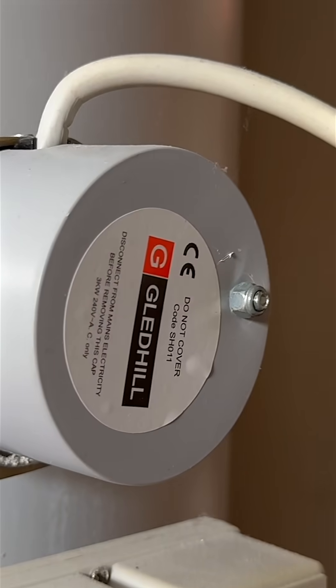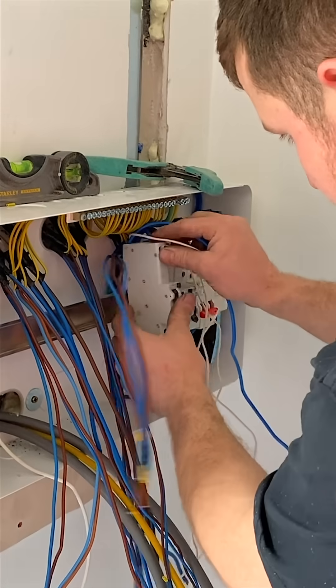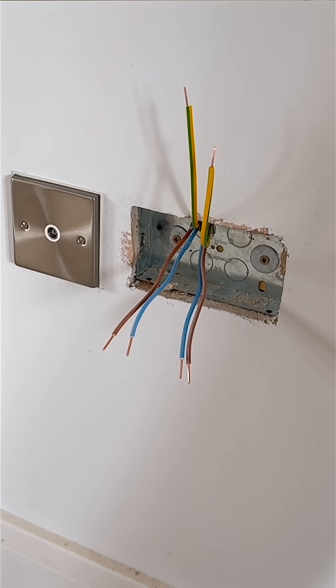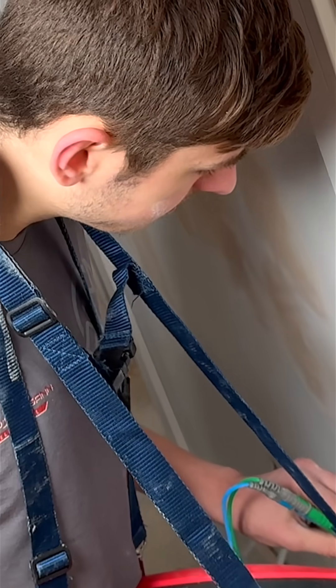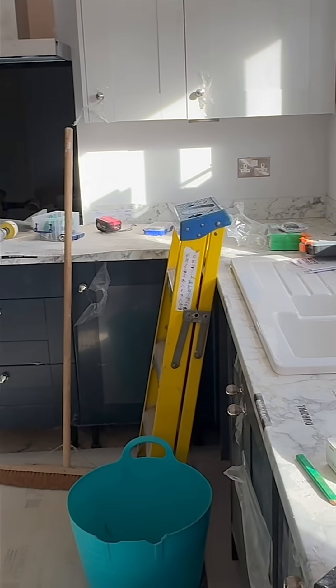Things like immersions, heaters, showers, and incandescent lamps should be disconnected. Make sure the wiring is completed before you apply 500 volts DC. On a new installation, there's no excuse for not testing at 500 volts DC, as all components should be rated to handle this.